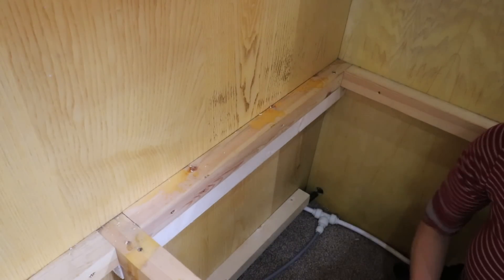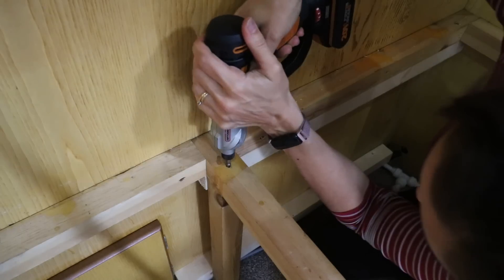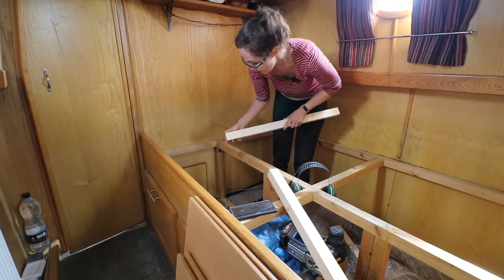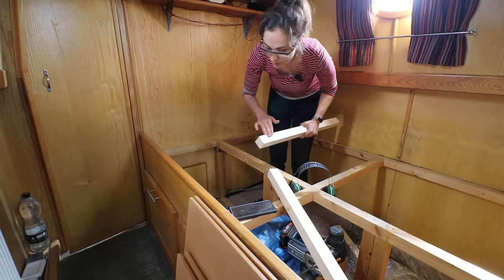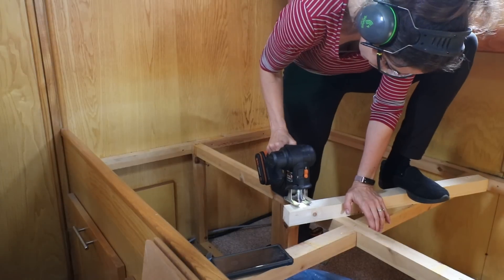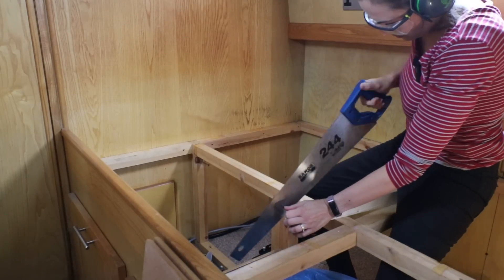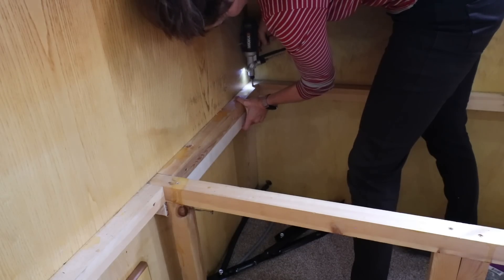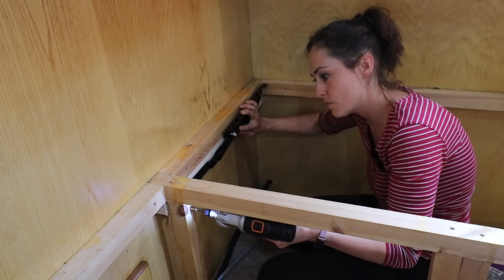We've come across our first hurdle. While it's in situ, the bracket definitely won't slot in. We tried to unscrew this to move it but the head is either ruined or we just can't get to it, so I've had to take it out. If I had some chisels, that would be easier to cut a notch out — which is what we're going to have to do. I'm going to try just doing a series of cuts with a jigsaw. After cutting a notch out, I was able to slot it in, and conveniently the original screw hole also went through the bracket screw hole while in situ.